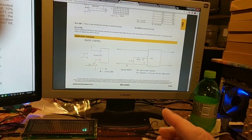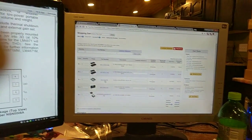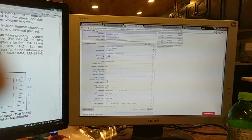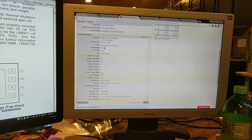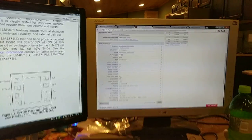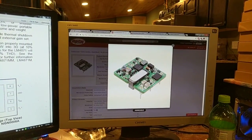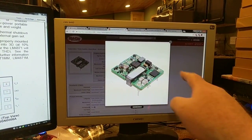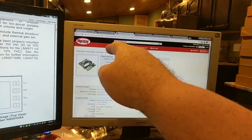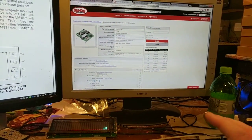The only thing I need to do is I have to have a 5 volt standby, which is no problem because, again, my next in line here is my 5 volt DC-DC converter, and it's rated for 3 amps, which should be plenty. The Raspberry Pi needs 3 amps by itself under full load, but it's not going to be fully loaded. It might need 2 amps max, which leaves an amp to mess around with on this and some other things. So this will be the 5 volt circuit, and this will run all the time, and its output will go into that high side load switch, which will cut the power off and everything else. But since that's hot all the time, that will go to the standby microcontroller, which I will get to when I start placing the circuit together.